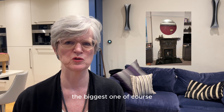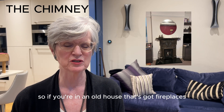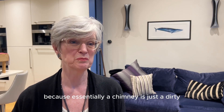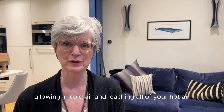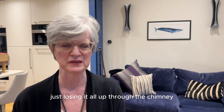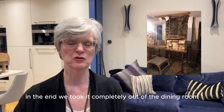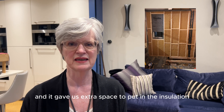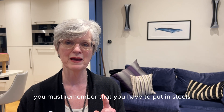Let's look at all the different places you need to address when thinking about airtightness. The biggest one has to be chimneys. If you're in an old house with fireplaces, think about what you want to do with them, because essentially a chimney is just a dirty great hole into your house allowing in cold air and losing all of your hot air up through it. We dealt with this by taking the chimneys out — we took one completely out of the dining room and it gave us extra space to put in insulation. It's a very dirty process, be prepared.